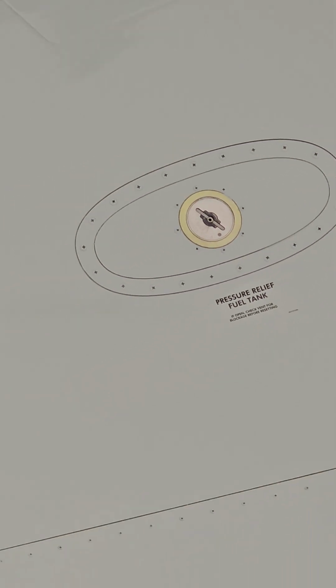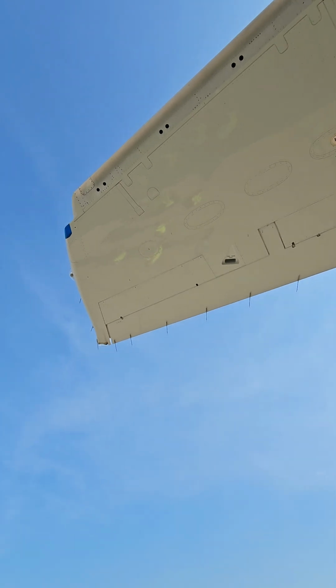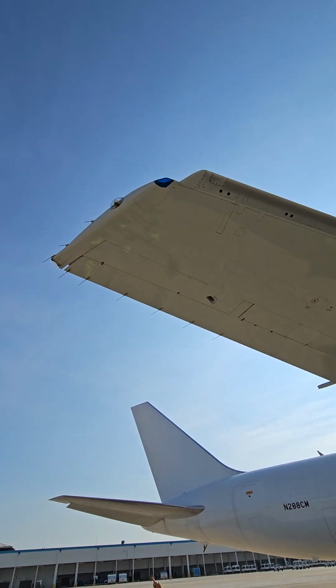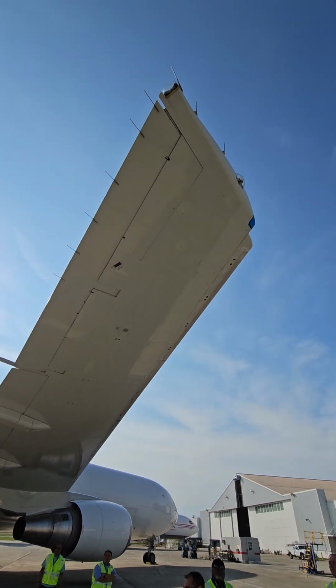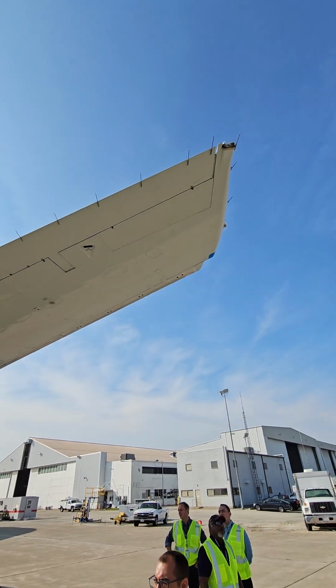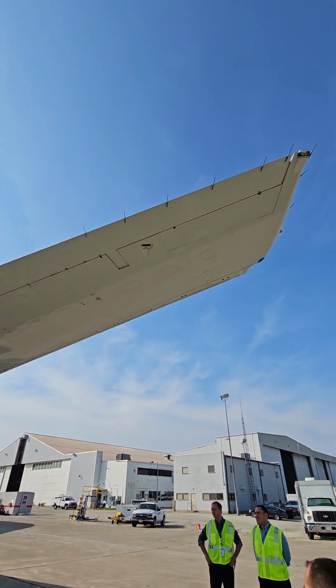I have four ailerons, right? Two outboard, two inboard ailerons on the 767. So I'm looking at that condition. I'm looking at the static discharge wicks. Where would I look to see how many of them I can have missing? MEL. CDL. Okay. Oh, CDL. Yeah. Which is part of the MEL. All right. I thought you'd be there.